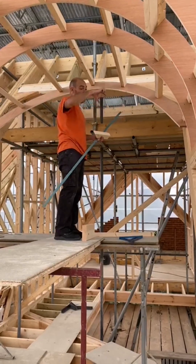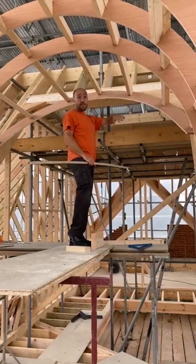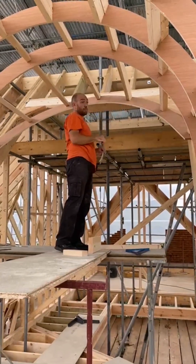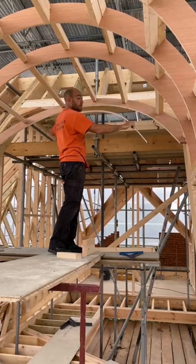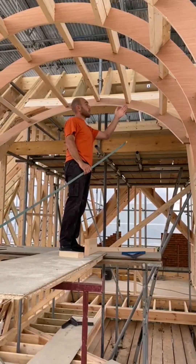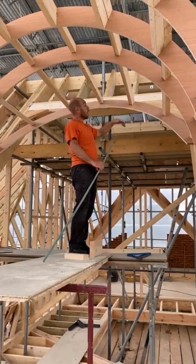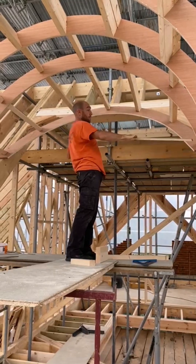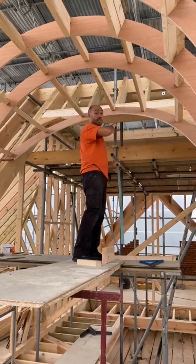When you lay that down, you'll have the top and the bottom point at each rafter. Now if you get that curve, it doesn't work like a semi-circle — depending on the pitch, it's more of an egg shape. So we put out the top and the bottom of each section of that rafter. Then we get a strip of timber and put it where the nails are and draw around it, top and bottom. You've got to take into consideration that the thickness of the ply will stick back in and the ceiling line needs to run through. So you'll either back-cut it — say 45° for example — or when you mark this through, on the bottom one you lift up 18mm for the thickness of the ply. Then you put an extra nail in and do that on every point, and you get a nice line — that's how you get your curve.